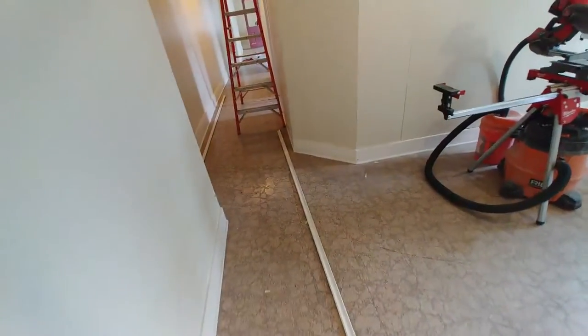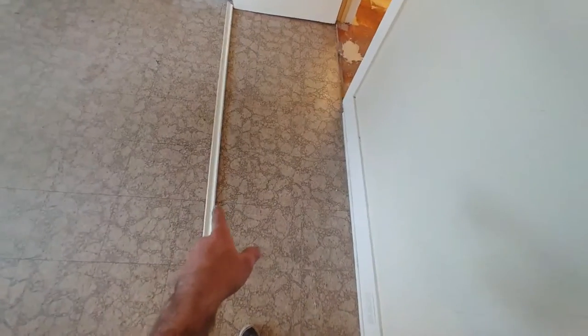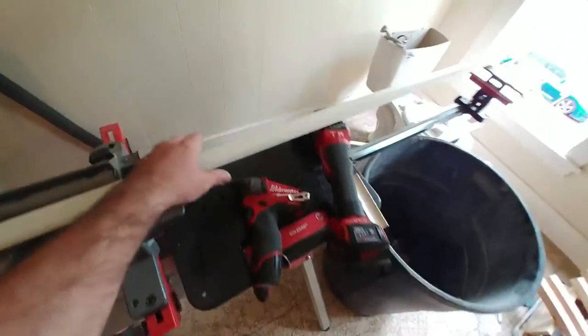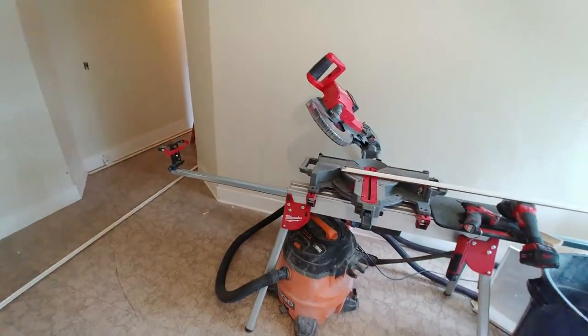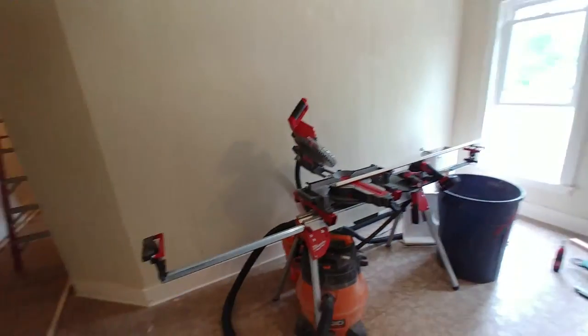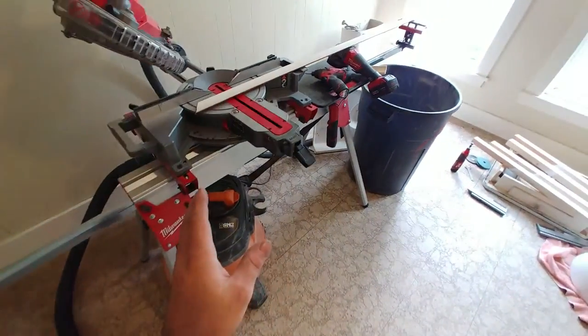I got a pile of two-inch cove and three-inch cove from a friend who bought a house from a finished carpenter — got it for free. It came with this antique white that's almost exactly our trim color, so it's real close. I'm not going to pre-paint it, however I would recommend that people do, because when you lay crown molding down on its back you can paint all the sides easily with a clean crisp brush. Get a couple great coats on there, brush it out smooth and perfect, let it dry — and then when it goes up you need very little hole filling and touch-up. You don't want to crank your neck around painting the bottom face of crown all the way around the room. If the trim isn't up already, paint it first for sure.